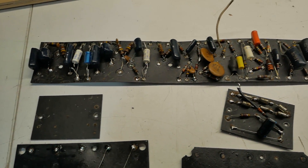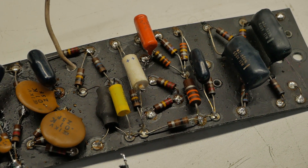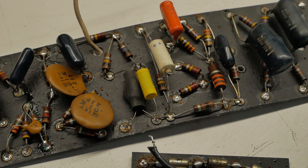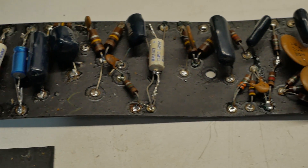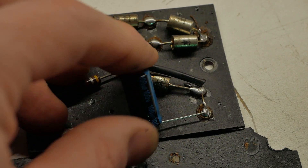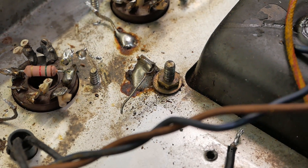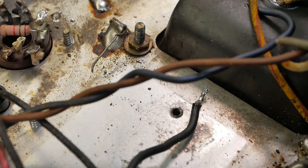Then we'll clean the hell out of them and repopulate as I see fit. Some of that will be replacing original components that have been tampered with, some replacing originals whose values I want to improve, some may have drifted, and some may be aftermarket substitutions from the previous tech. I'll replace those old diodes with new 1N-series silicons, replace the bias resistors with metal film - that's one place where you don't want drift - and put a new axial filter cap on the bias supply. I'll also remove all the grounds from the transformer hardware where they're doing double duty.